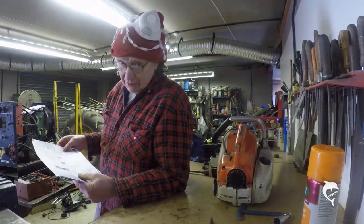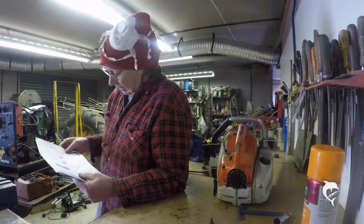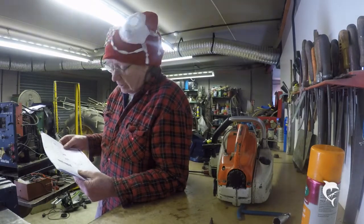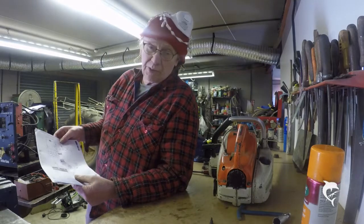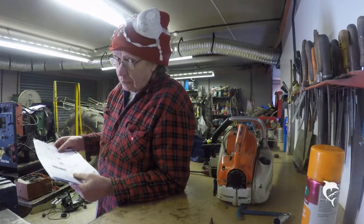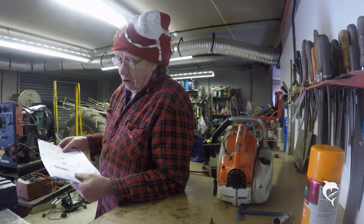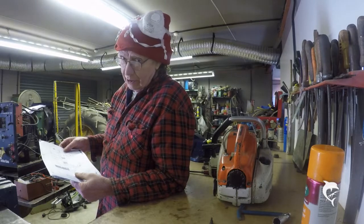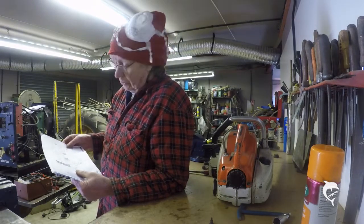I did find one or two very dodgy connections, some taped up or sleeved up spade tags, which are obviously from factory, which were a little bit loose and a little bit green, but they're not on low voltage, they're on 110 volts, so they should be okay, but you never know. I've cleaned those up and done.